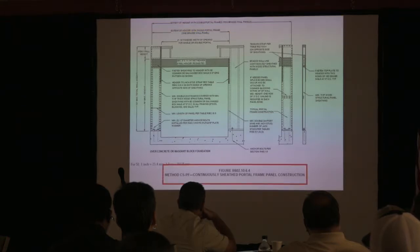So what I want to do first, we've got that down, but I wanted to point out that there are two terms for height in here, okay? You've got a total wall height and a maximum height. The maximum height is dealing with what the bracing up to the header is. And the total wall height includes what we would call a cripple wall, but they call a pony wall.